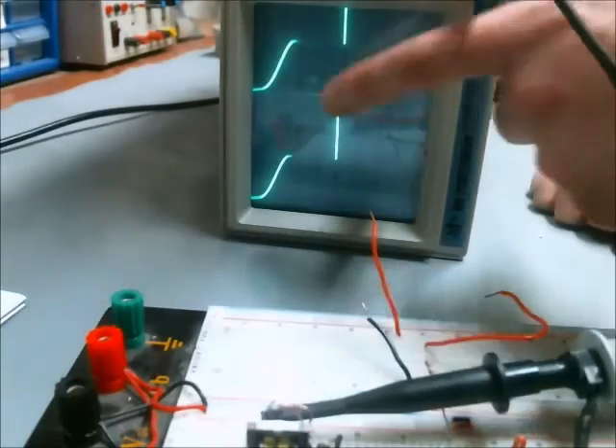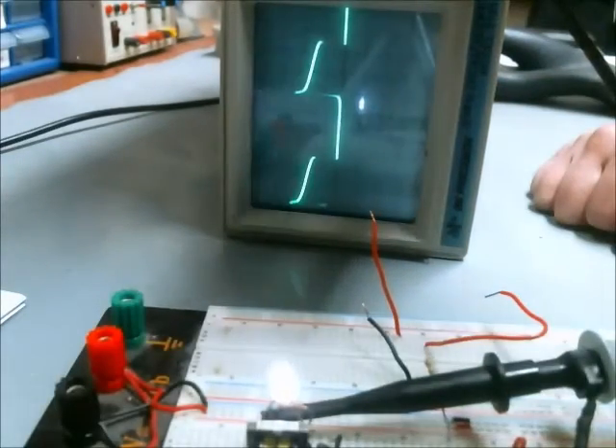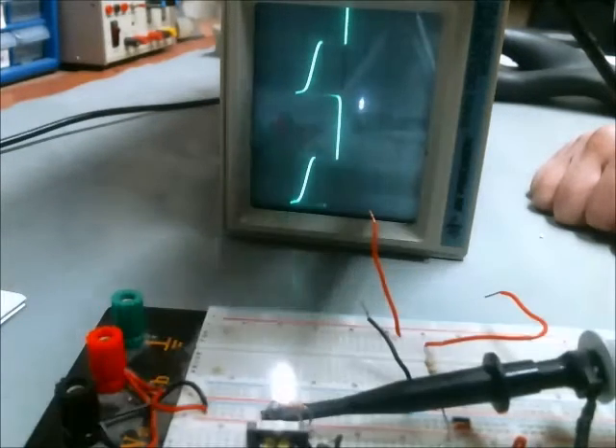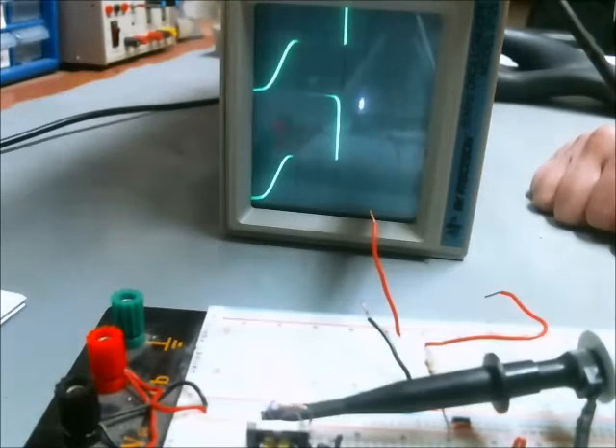You can see the spike exceeds 4 volts. At 2 volts per division, it looks like it's spiking at 5 volts. So I'll put it back to 1 volt per division. I'm going to let this run for a bit and see if that issue comes back — and if it doesn't, I'll need to look at possible influences from the case.